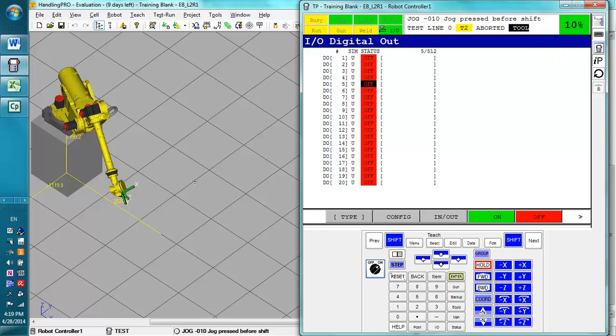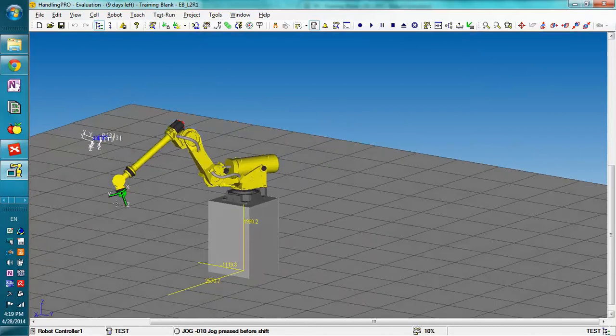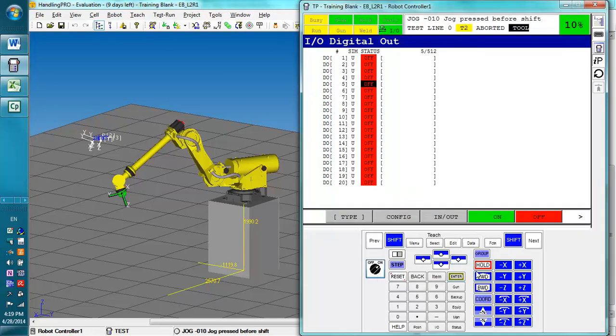Now this is just the default tool frame, it hasn't been adjusted or anything. You can adjust it so that the tool coordinate frame is however you want it, but by default it's just with the Z going outwards from the center of the 6-axis, and the X and Y are perpendicular right here. The main thing this is used for is if you need to go in and out of certain areas which are not necessarily within the XY frame, or if you need to run a part parallel at an odd angle. It's just something you have to get a little used to.